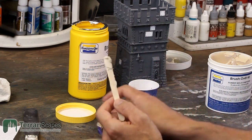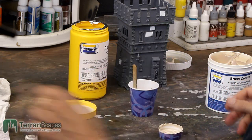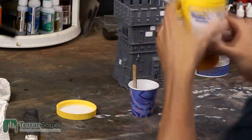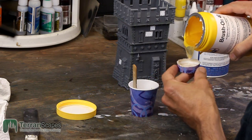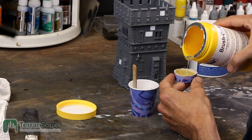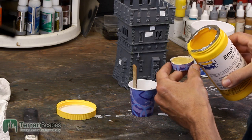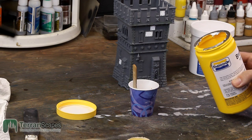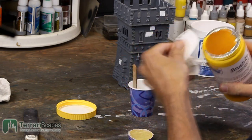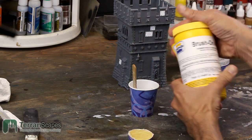The reason I do it that way is I can just pour Part B into this without having to spoon any of it out, making it easier to use just one stick. As soon as I'm done with this material, I would normally spray dry gas into it — dry gas is an aerosol that basically has no moisture in it, so it prevents moisture from getting in when you close the cap. Wipe your threads, because as material builds up on them it will break the tight seal, and then moisture gets into your rubber compound much more easily.